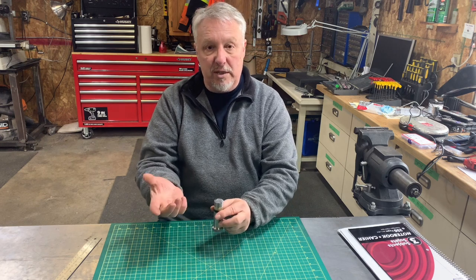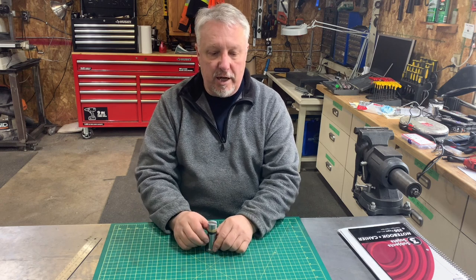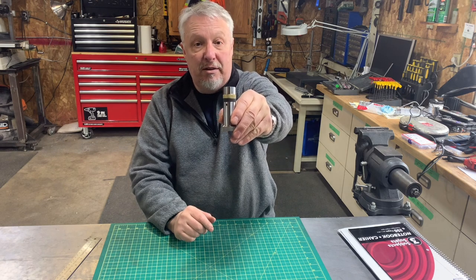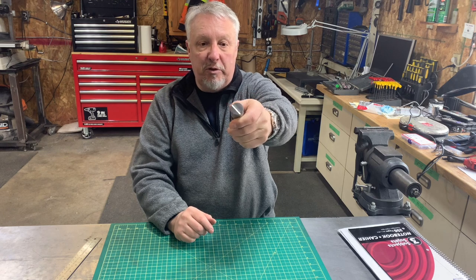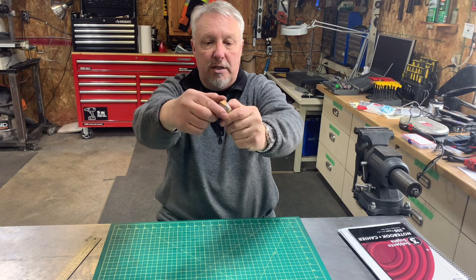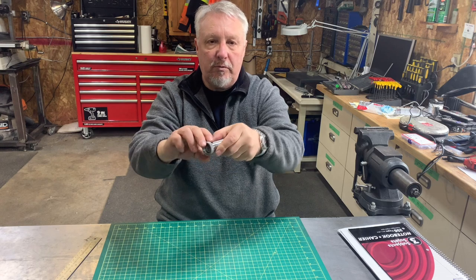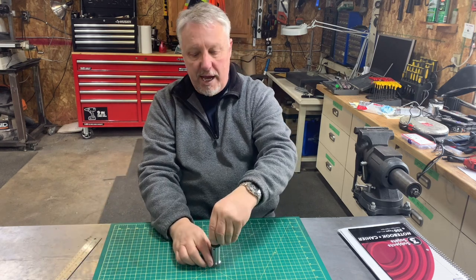So, what's interesting about this screwjack? Well, it's got some interesting features. You know, it looks pretty. It's gonna have a hardened top with a V-groove and interchangeable heads, which is its primary feature in my book. It's stackable and it comes up to about 6 inches.